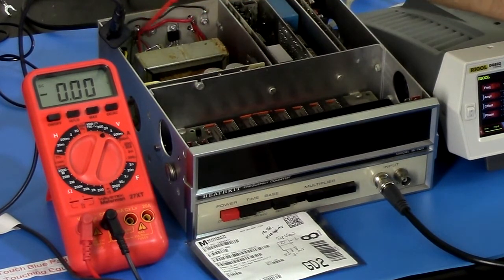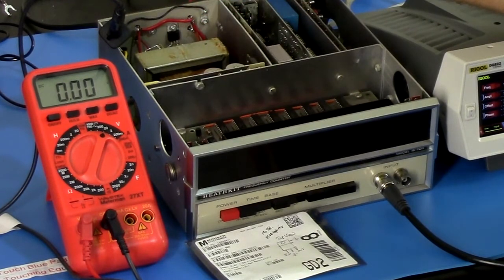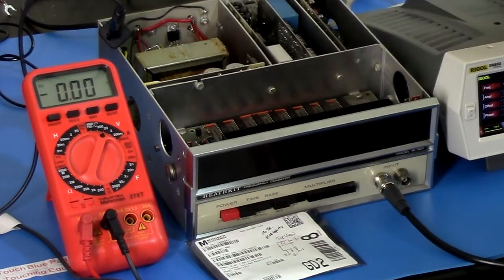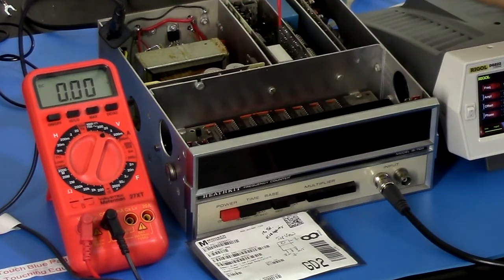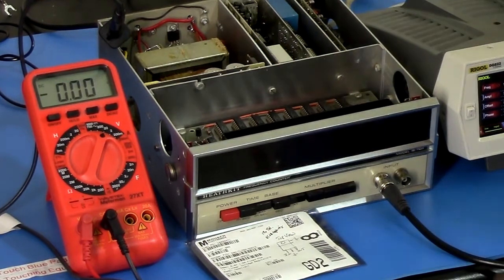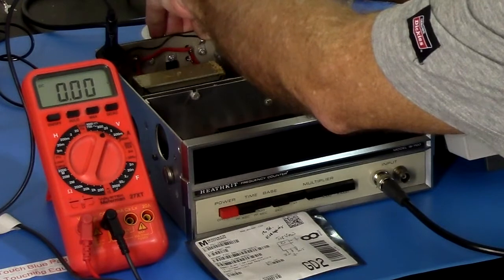I took 5 volt. No, this is the unregulated input. That goes to the in. The ground is actually the tab there. So that's grounded to the TO3, through the TO3 case of the other regulator. And then the output here is that lead which goes to this board. So let's see what happens. I'm going to tilt it down here.